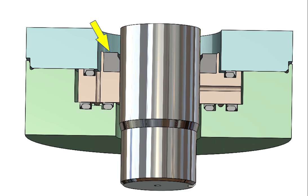A rotary seal is mounted in a patented metal backup ring. The rotary seal is compressed radially and establishes sealing between the backup ring and the shaft. The bore of the metal backup ring has a close fit with the shaft and locates the backup ring laterally.